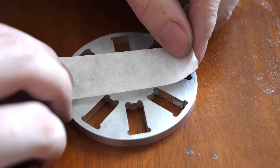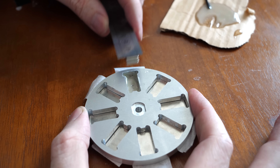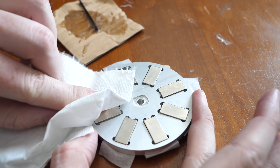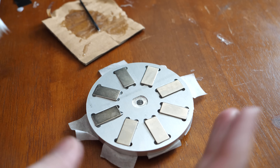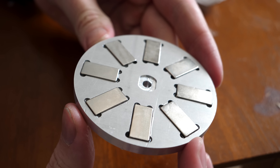So I started building a rotor that will mount to the same axle as the flywheel and hold a bunch of magnets all orientated with opposing poles facing up. This meant that one magnet would have its north pole facing up and the magnet next to it would have its south pole facing up, and so on.